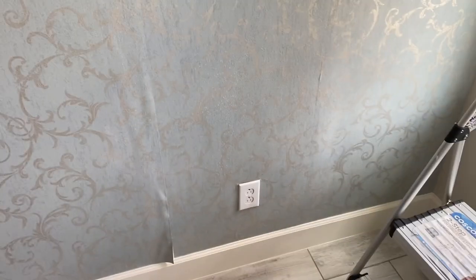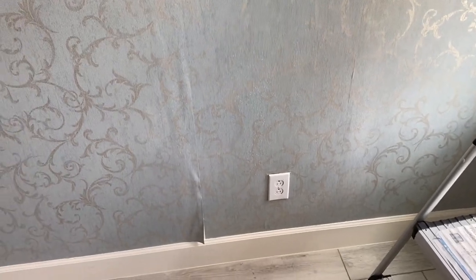So we're pasting the wall. Whether or not this product is paste the wall or paste the product, doesn't matter. I have dampened my paper with water and now I'm putting full strength, clear, type 2 vinyl paste on the wall to form the perfect bond. Okay, moving right along, I direct your attention only right now to the panel above the socket.